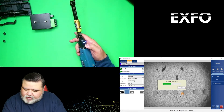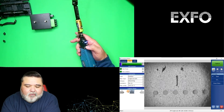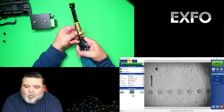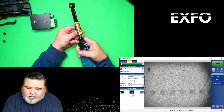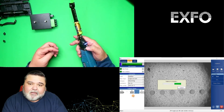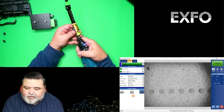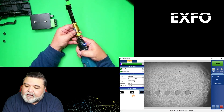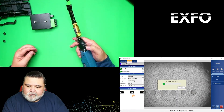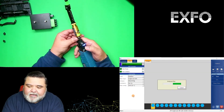I'll go ahead and hit the capture button to capture the first step. Down in the fiber inspection software you'll see the section showing the different steps and which step you're in. Right now it's in between analysis, so now it wants us to go to the second step. I'll gently pull to the second step — once you get used to the strength and pull of your device, it becomes muscle memory. I'm taking the second image and capturing that information, then pulling one more time all the way to the end for the third state and capturing a final time.